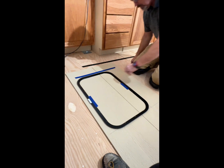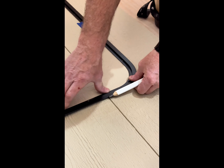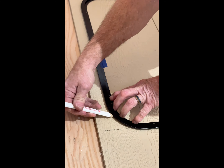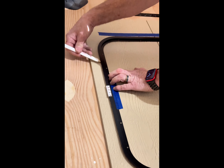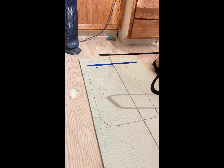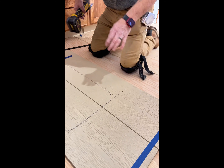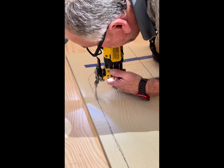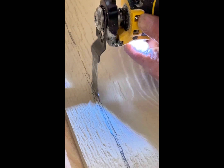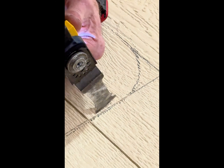Just a quick view of how we got our template on the outside: tape the internal frame of the window and use it to mark with. When I have multiple windows I'll make a template to use, but this is how we used it — got it all marked out nice and neat. As I'm cutting with the zippy, I give a scribe line to start with. This way everything fits nice and snug; I'll leave just a little bit of room for making sure it's plumb and level.